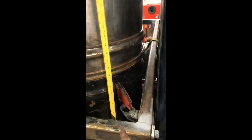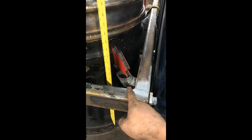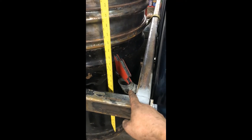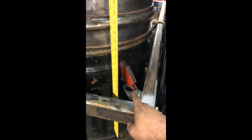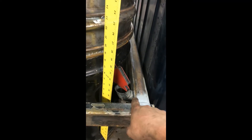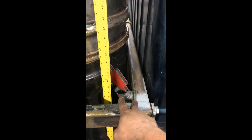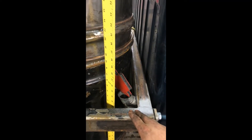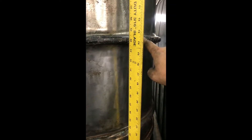We need to connect the upper gutter and the lower gutter down into the tar tank and the front rail assembly. I have some inch and seven-eighths OD galvanized fence pipe material — it's what I'll be using for my tar drain and for my cooler tubes. My last build I did inch and five-eighths, and I had an issue with the tar pipe stopping up, so I'm going a little bit bigger. But I'm also running with whatever material I've got. It's going to drop into the rail right here. I have two pieces cut on 22.5-degree angles welded together — that comes up to a flat surface. I want to make sure I'm going to clear this lip, this lip, and the biggest lip — this clamp ring.